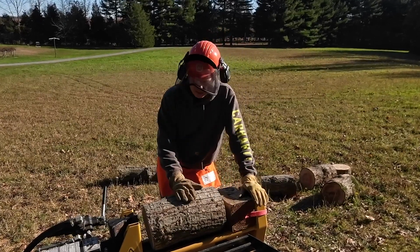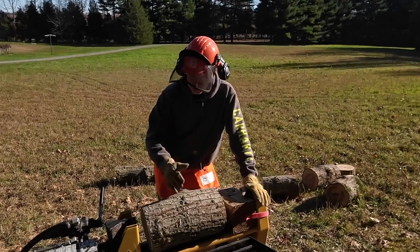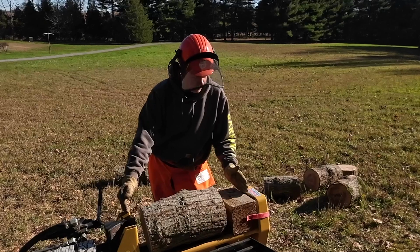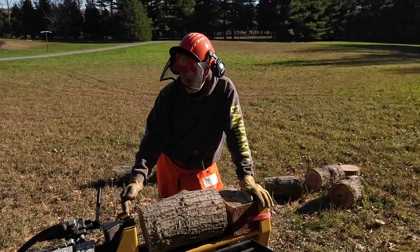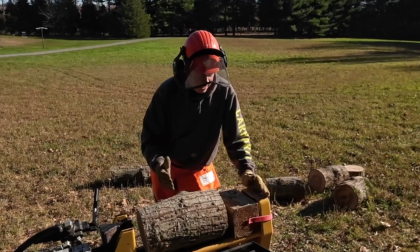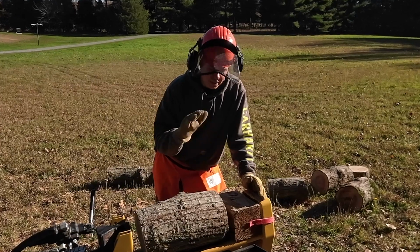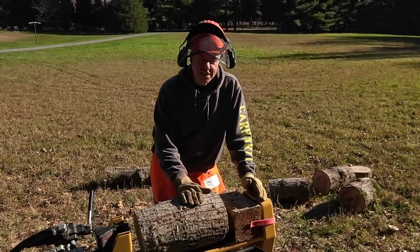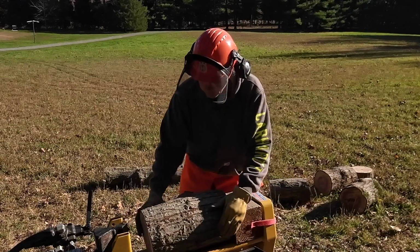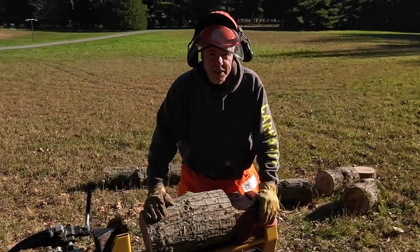And the reason I did that was to save some time, because using the auto return, this will hold like a 22, 24-inch piece of wood. So by using the auto return, it will return all the way, and then if the block isn't here, then you've got to wait for that to travel to meet up with the piece of wood, 16-inch in this case. So I have that block there, which basically shortens the throw here, and you know, it saves milliseconds, but that all adds up.